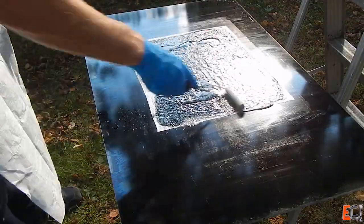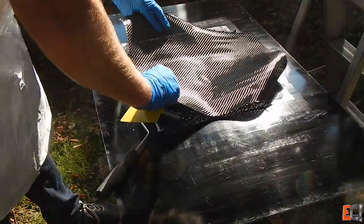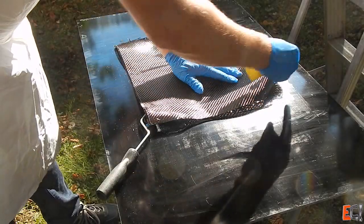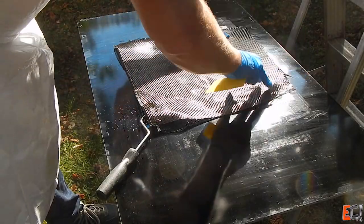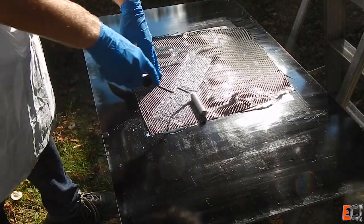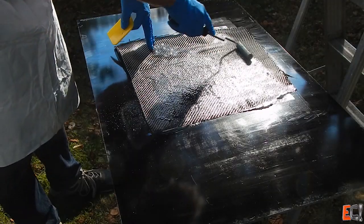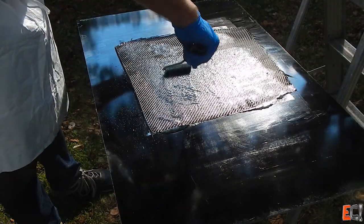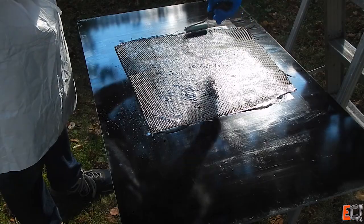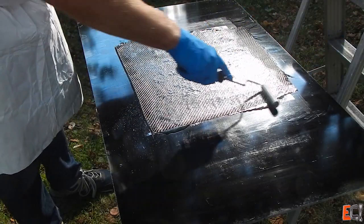After making sure that first ply is really nice, I'm going to drop the carbon on there. Normally you wouldn't really get any benefit from using carbon with polyester resin. If you're going to use carbon for structural purposes, you should probably stick to epoxy, because the polyester just doesn't bond to the fiber well enough to make use of the carbon's properties. But here it's just got to look good, so I'm going to try to roll that out nicely.